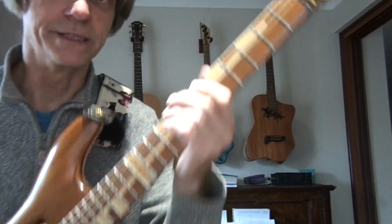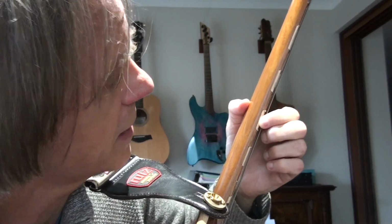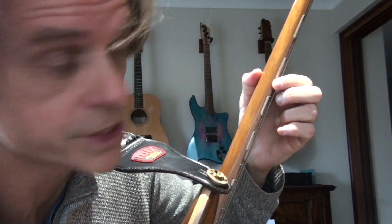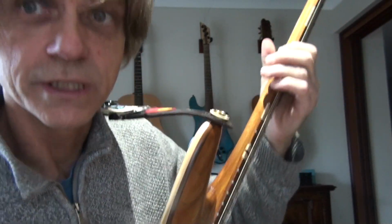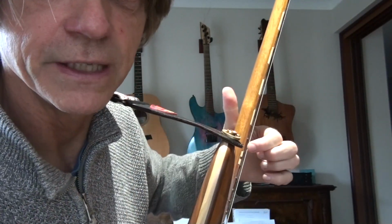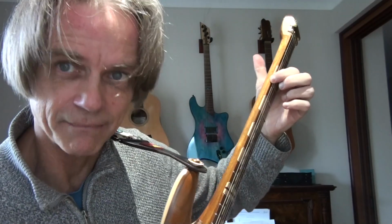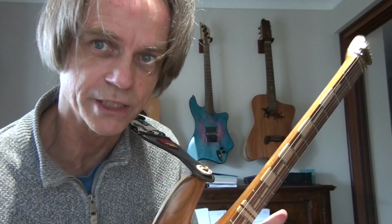It's quite a deep inlay because I wanted to use it as side dots as well. So here on the side, the fretboard is 5 millimeters thick, and 3 millimeters of that is the maple, and there's a 2 millimeter bit under that, which is blackwood. I use the same material for the neck as the fretboard so that if these maple bits didn't turn out the same thickness, it's harder to tell because you don't have a hard fretboard line to judge it from.